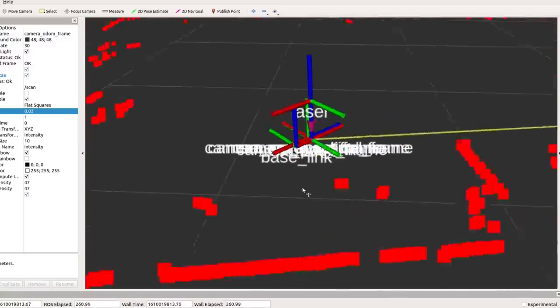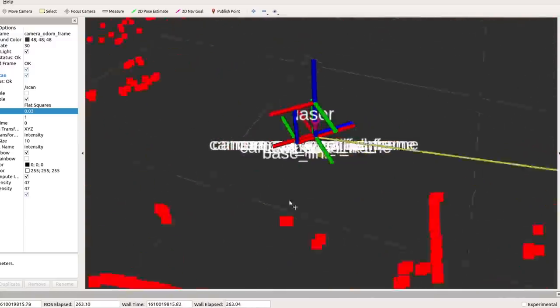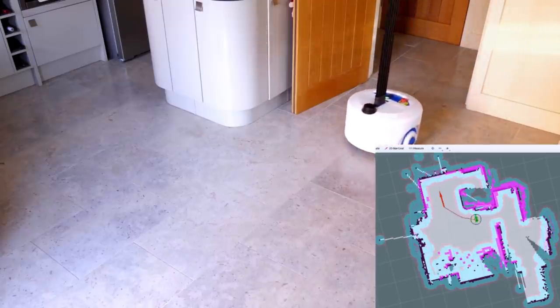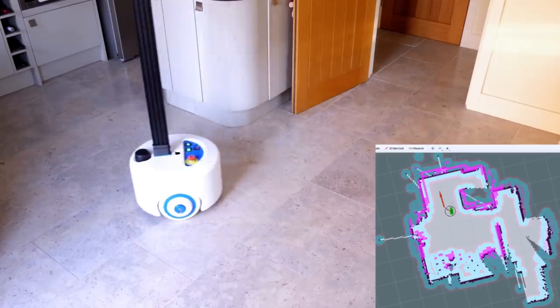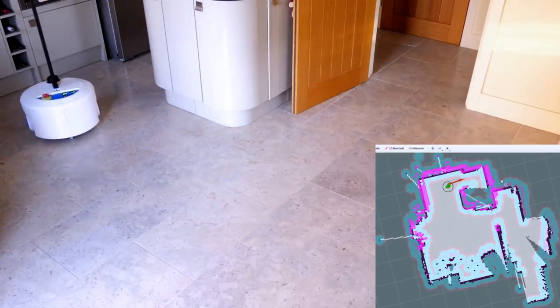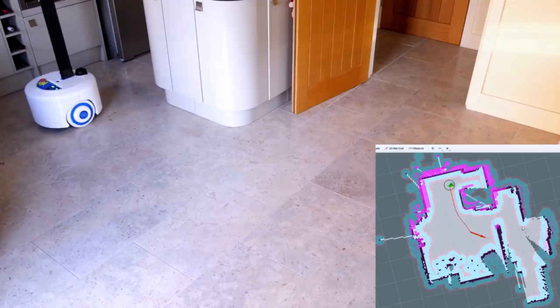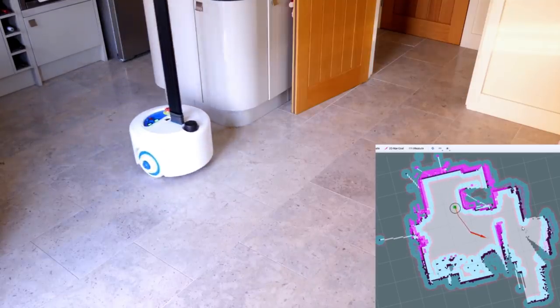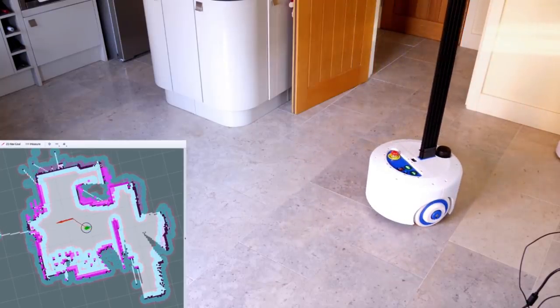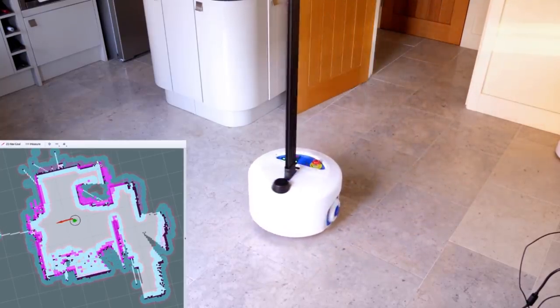And you can see the laser scan is at the right level for the laser, which is above the camera. My really useful robot that you can find in my channel already does mapping and navigation with ROS really well. This is using wheel odometry as well as the laser, but we've already got a good configuration for the navigation stack and there's quite a lot to it. So all we really need to do is take most of that configuration and apply it to the new robot.